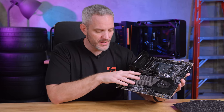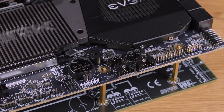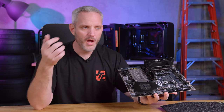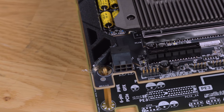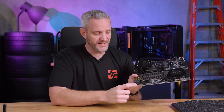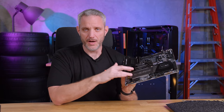Not a whole lot of PCIe connectivity, but again, this board is designed for extreme overclocking. On the bottom we've got two USB 2.0 headers — and I've seen a lot of boards omit USB 2.0, but if you've got AIOs or lighting controllers, they usually need a standard 2.0 header. There's also supplemental 6-pin PCIe power down here. When you're running two overclocked 3090s, our Kingpin cards pull 600 watts or more per card under XOC, so you need supplemental power to avoid overloading the PCIe 75-watt power delivery and burning out the traces or headers.